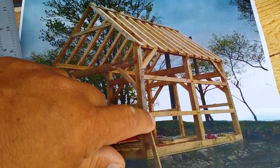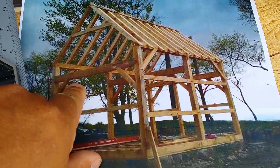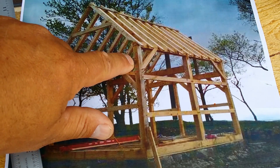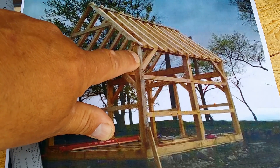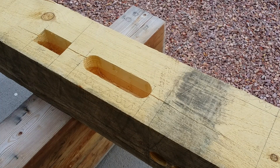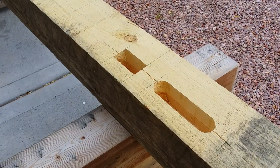When I do the joinery, that's what I'm doing. This main tie beam tenon needs to be super strong, so that's why it's a through tenon — it actually goes all the way through the beam. This tenon is full length, and the end of the tenon will be visible on the outside of the post. Basically, that's the brace pocket and a pocket for one of the girts.